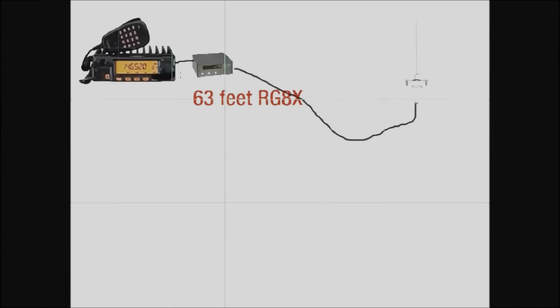Okay, let's set up our station here. We're going to start with the transceiver that puts out 100 watts on 146 MHz — so 100 watts on the 2-meter band. We'll set up a 2-meter ground plane outside, and between the transceiver and the ground plane we'll have RG-8X — specifically 63 feet of RG-8X between the transceiver and the antenna. We'll put an SWR meter about 2 feet from the transceiver using a short jumper so that we can measure the forward and reflected power and the SWR. So let's put 100 watts into the coax to the antenna and take a reading at the SWR meter.